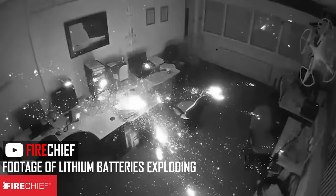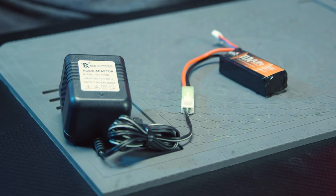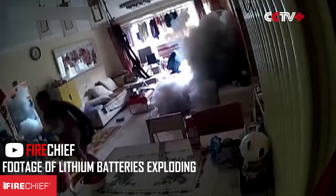The most common mistake people will make with a lipo battery is incorrectly charging it. They'll buy their lipo battery and not buy a lipo charger. Instead they'll use a wall charger that maybe came with their airsoft gun or they bought for five bucks — it's the cheapest way to burn your house down. The problem with this charger is that it's made to just dump electricity into the battery, so it'll keep charging past full until boom — explosion — and suddenly your house is gone.